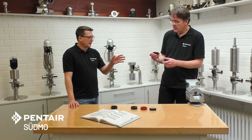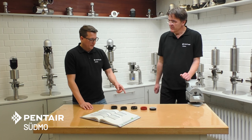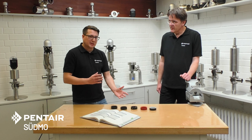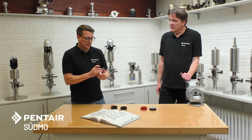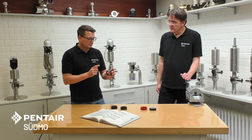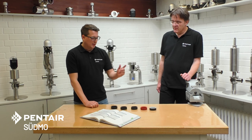But be careful with higher acid concentration, so it has a little bit of a limitation there. There is another seal which is typically used in applications with high food oil concentration, or typically soft drinks like cola. This is FKM — a good choice for these kinds of products.